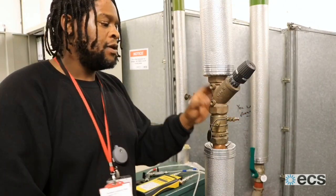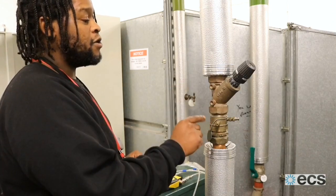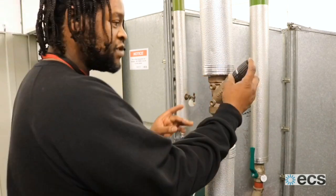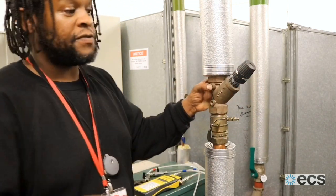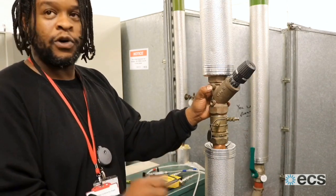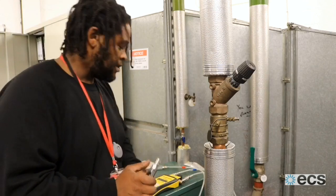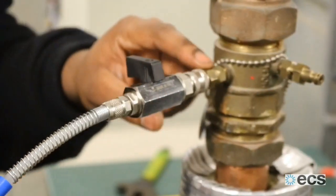What we're doing is setting the right flow rate in litres per second with this regulating valve to achieve the design specification for heat transfer for the coil. Firstly, we attach the low side of our meter to the system, and now I need to open this valve.